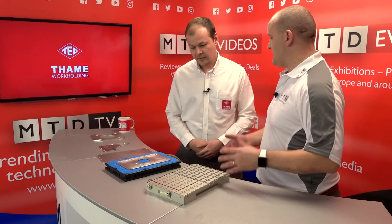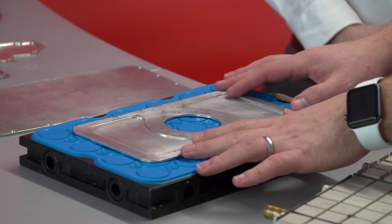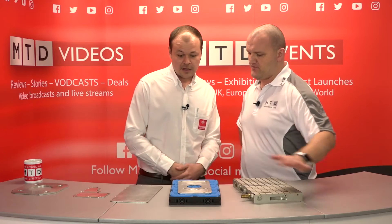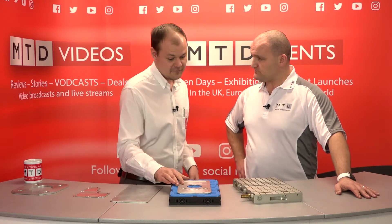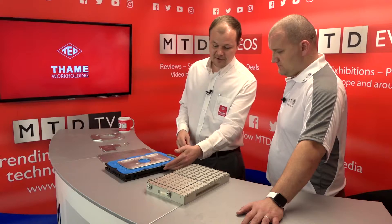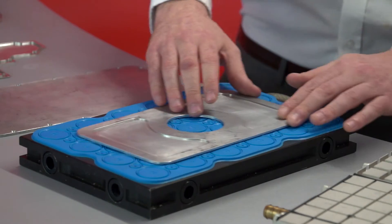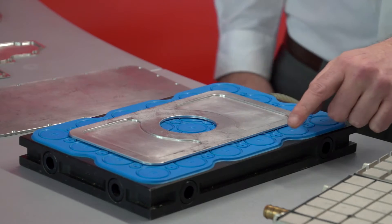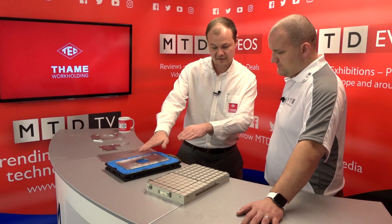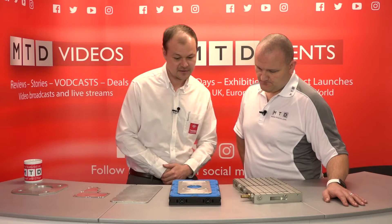It's easier to hold and quicker to set up. How about repeatability if I've got five of these? Do we have to guess how it goes on, do we have to probe it — how can we guarantee it'll be machined the same every time? The flatness tolerance is about 15 microns, so you get quite good flatness. We also supply edge stops so you can put the part into the edge of the plate, repeating again within about 15 microns. There are also spaces in the top of the plate to put dowels so you can repeat back against those. So there are various different ways of making it repeat.